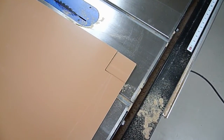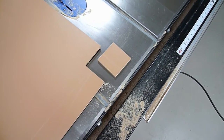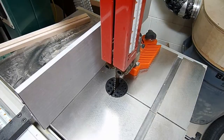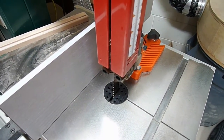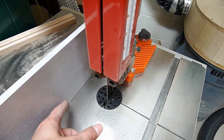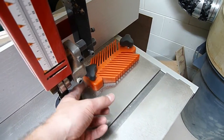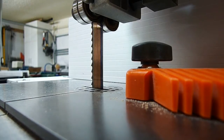I'm cutting out the panel for the bottom of the rolling base and I just need to cut four notches, one in each corner, to go around those four-by-fours. I'll show you a quick way to do that if you've got a band saw. All you got to do is take a width measurement on what you've got in the base there and then add an eighth of an inch for wiggle room. You can do it on both sides, and then whatever that measurement was, I did from the front of the blade back. I just used a magnetic stop board so this will create a perfect square.